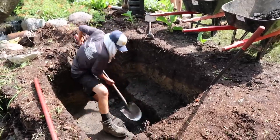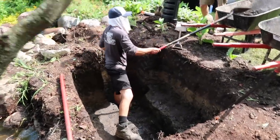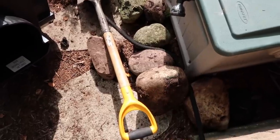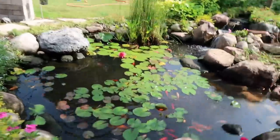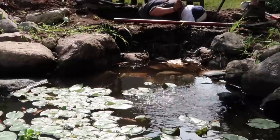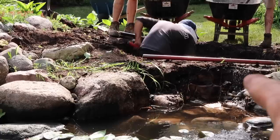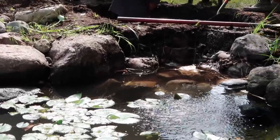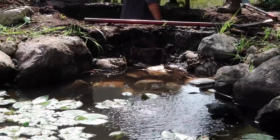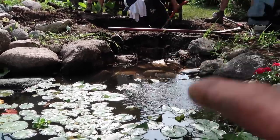Matt's just going to finish cleaning up the hole. Once we get the fabric and liner in, then the snorkel and half centipede, we'll start throwing cobbles on top — that bigger softball-sized strata that bacteria will work their way through — then up through a mix of pond gravel, eventually up-flow and overflow into the pond. We shot elevations and we've drained a little bit of water out of the pond. We determined that we can pull off an overlap: the water level coming out of the bog will give us a six-inch drop into the pond. That six-inch elevation change ensures water won't back up between the two liners and leak out the low edge.